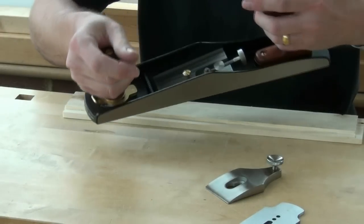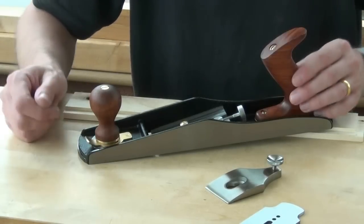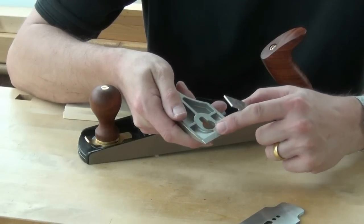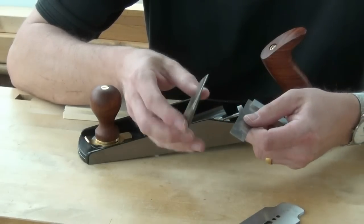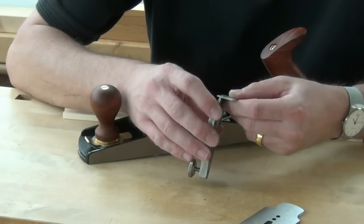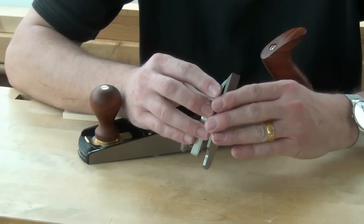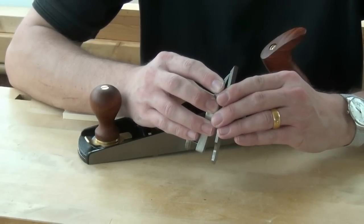The handles have a nice feel to them — nothing sharp, they feel quite sturdy. All the brass screws used have a reasonably good finish. The lever cap is a casting; it looks quite nice and is well finished on top. However, I suspect the face that touches the iron looks a bit rough. Checking with the blade of my try square, it doesn't mate all that well, and against the iron itself I can feel a little bit of rock. So I think I'll need to do a little bit of work on it to get the best performance.